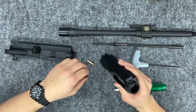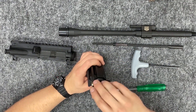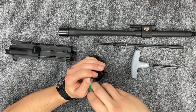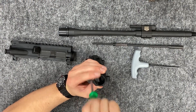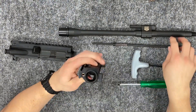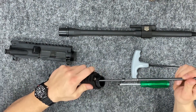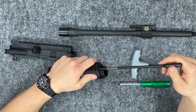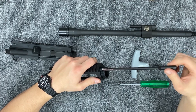That's what that little hollow set screw is. From there, you're going to take the gas piston bushing, drop it down, and thread it in with a flat blade screwdriver. Throw it down till it's flush, and that's it — installed in the upper. The whole point for this is your gas piston setup right here: your rod goes through, and it's a more precise surface than most other uppers out there.